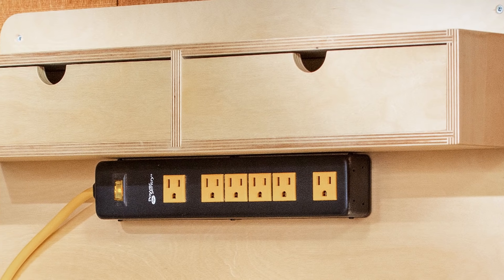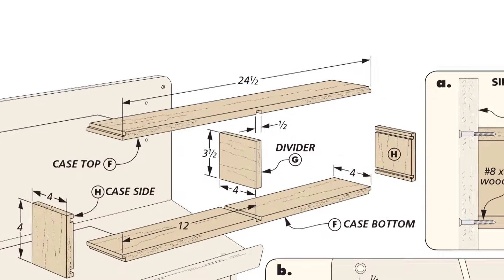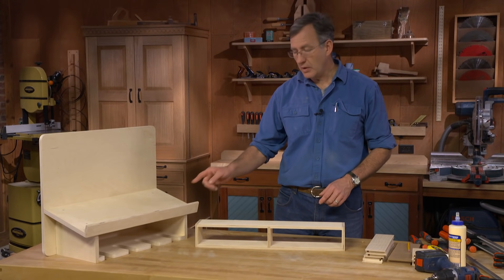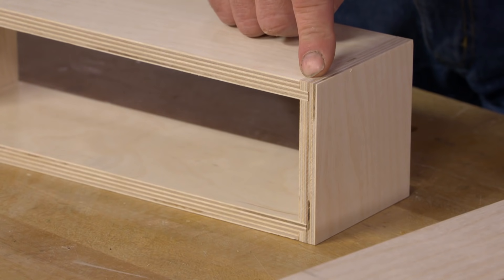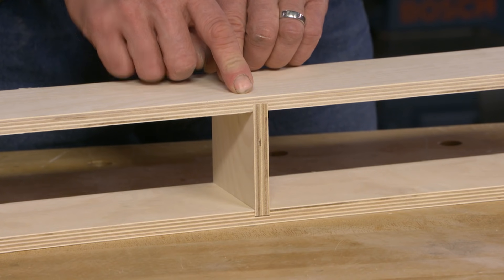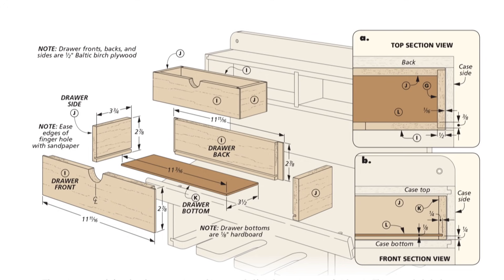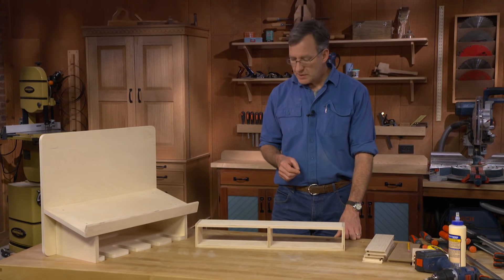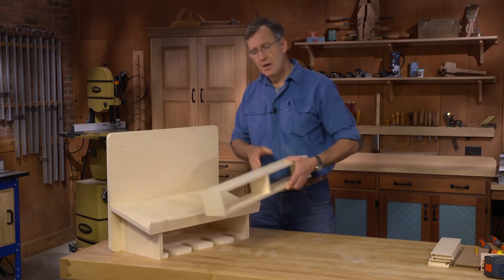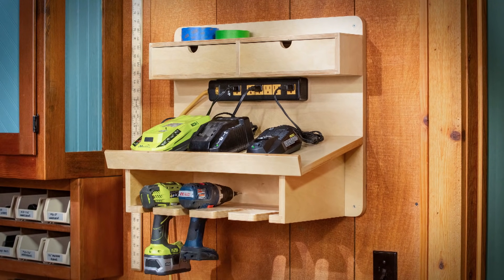The storage unit, which mounts on top of our charging station, is very simple. It consists of a shell and two drawers. The shell has a top, a bottom, two ends, and a divider. The joinery is similar to what you've already seen — grooves cut on the top and bottom of the ends, and a tongue formed on the ends of the top and bottom. A simple dado houses the divider. The drawers are equally simple, with rabbet joints and an eighth-inch perimeter groove on the interior to hold an eighth-inch masonite bottom. Once assembled, we'll attach the shell to the back with four screws, then sand the piece, apply finish, hang it on the wall, and clear all those chargers from your workbench.